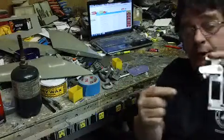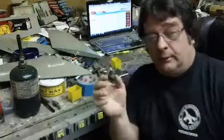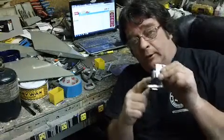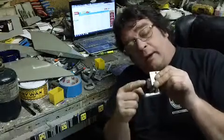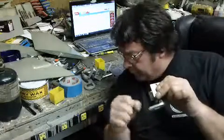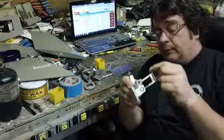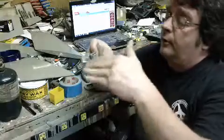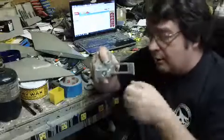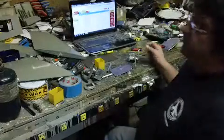But the thing is, when you tighten these up from the bottom of the plane, you should do this on all your jets. Okay? When you tighten up this set screw and then move to this one, tighten it up, then go back to this one. Tighten it up some more, then go back to that one, and go back and forth 3 or 4 times until neither one of them move anymore. You just don't want it, because when you tighten this one up, it kind of pulls it at an angle, then tighten this one up. Well, it's going to pull a little bit of slack in that one. So you kind of got to go back and forth a couple times. Make sure you get them good and taut.